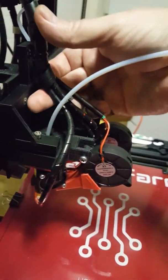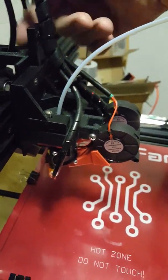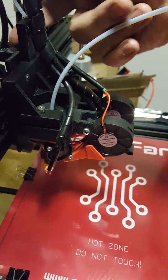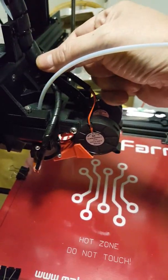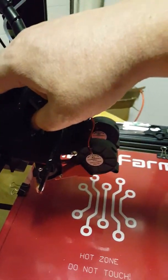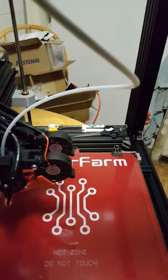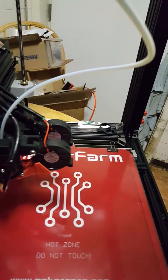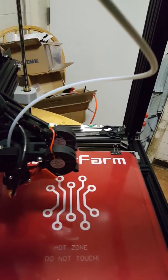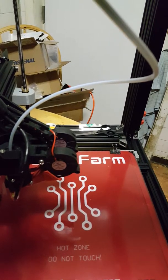I've got a lot of adjusting to do on these nozzles to get them where I want them, but I'll give you the quick walk-around. There are going to be a few changes yet to be made in the next version — this bracket won't be here, and it will lay back. The bracket will actually continue out to the front, the wiring will be tied there, and that'll give me about another twenty-plus millimeters in height on the carriage to print a little bit higher — I think up to about 245 or 250 millimeters.